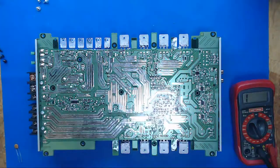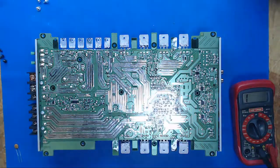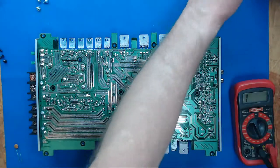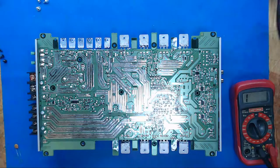Soldering iron sponge wet here. Always use your sponge, your copper bristles, or your brass bristles. Keep your soldering iron tip super clean. Make the tip last a whole lot longer.